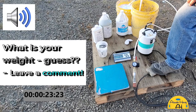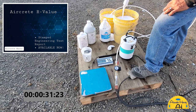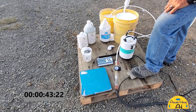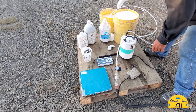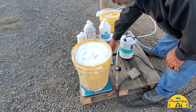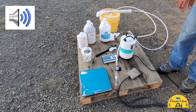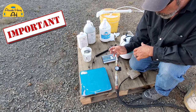We got good flow, so I turned the air on. After you're done, you want to turn your air off. This is the first bucket — we're going to weigh it and see how we did. That says nine pounds one ounce — that's way too heavy. So what we have to do is turn the valve to add more air pressure. Adding more air will make the mix lighter.